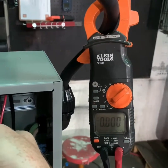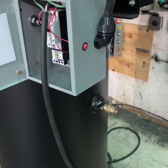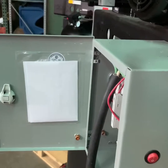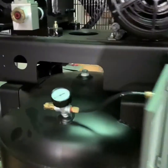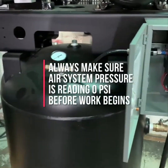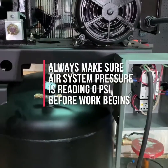Once you have verified there is no power, you can move on to the next step: draining the tank or system pressure to make sure that the compressor is safe to work on. Drain the system pressure from the tank down to zero. Check your tank pressure gauge to confirm it reads zero. You can also pull the tank safety valve, which is typically located somewhere near the gauge, to make sure no pressure remains in the tank.